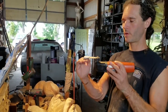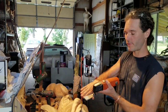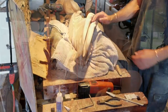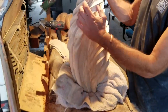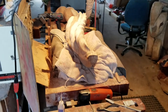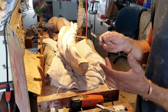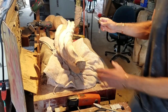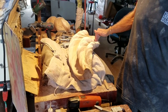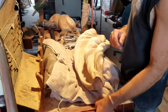Using this, standing on this side is more controllable, and a little tip: because of its vibrating action it will want to run away, so it's one of those things the more you do it the better you get at it. I depend on this tool. This initial path was made with a small chainsaw, but then it fades into tighter gaps. By vibrating you can plunge right in there — that's how I generated that movement. I can sand it to a perfect 1500 grit scratchless finish just by doing that.